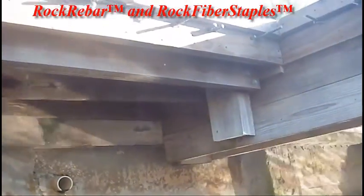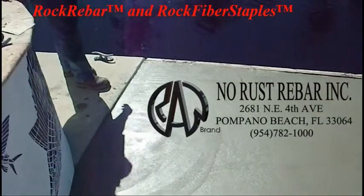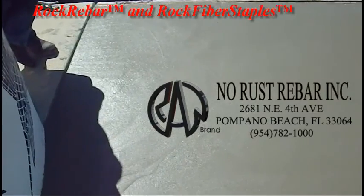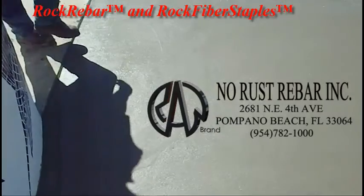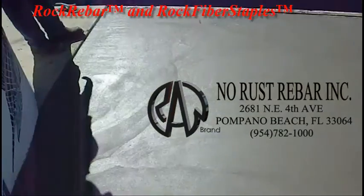Video of the underside - this is the old dock and where we put the forms on it. I'm down here to see how much it sags - they're putting 43,000 pounds of concrete on top of it. What do you notice about those fibers? They stay down better than the other ones. They're heavier and we put an agent on it to keep them from sticking together and make them disperse out into the mix better. You can't really notice them when you're troweling the surface - usually the other ones will be coming up on the surface. You don't really see them right now.